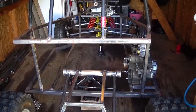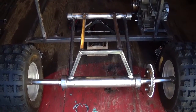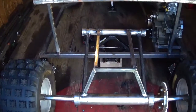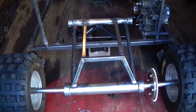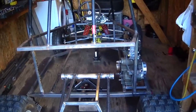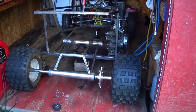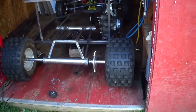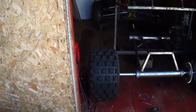So that's the plan so far — subject to change at all times. But I think it looks pretty cool. This shed is not leveled, so the whole time I work on this thing, when I build risers and stuff to hold this and the seat, I'm going to have to use all measurements from the frame up to get everything sort of straight, because I've established that the frame is straight and flat on the bottom. Nothing can be used as far as a level — have to use measurements only. This shed is so cooped up to work in, but it makes it so much easier to weld here and be able to come out here and work on it — just more convenient. I'm not even sure this thing could even come out of this building through the door with it all assembled. The back end can — I've established that. But I don't know about the front.